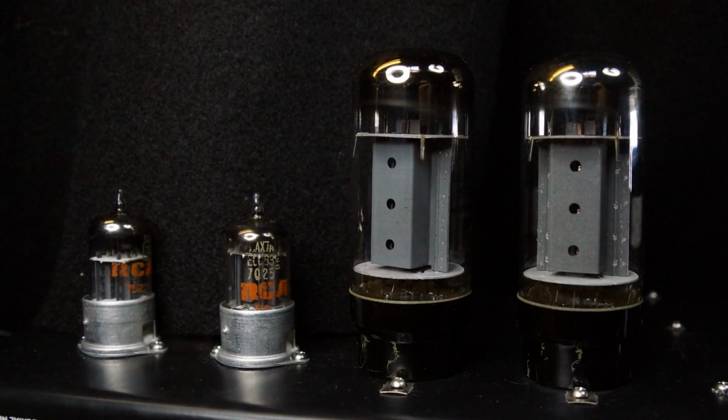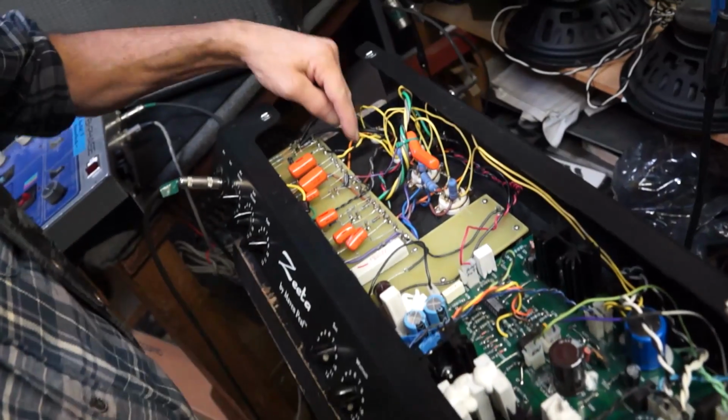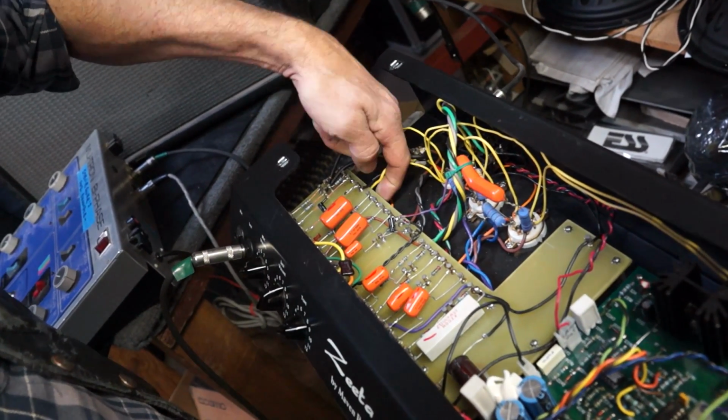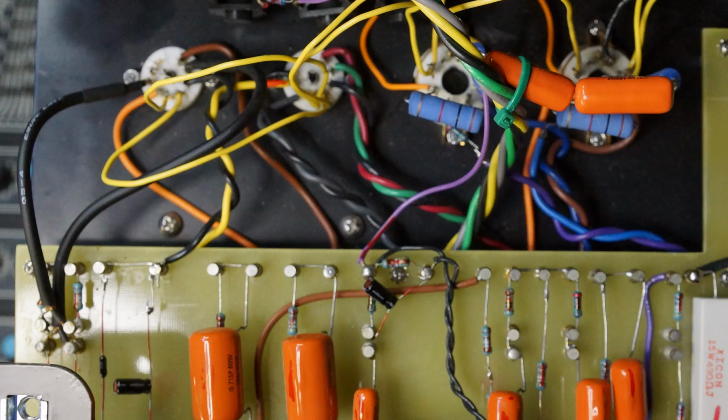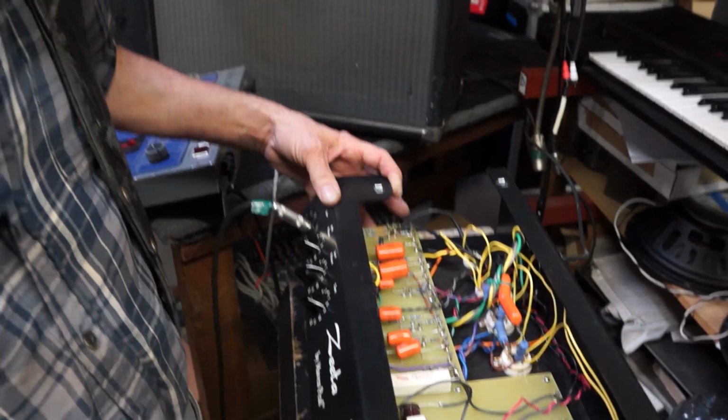We could spend the rest of our lives experimenting and swapping with this. My main challenge was to make it go again. What do you think was the problem? The 2 problems I found were broken wires underneath the circuit board. That was what was taking out the instrument channel, a broken wire. That was really quite simple once we figured out how to look for it.